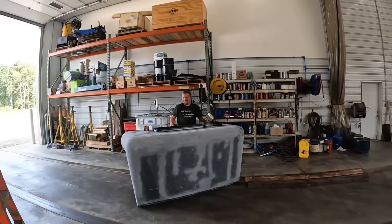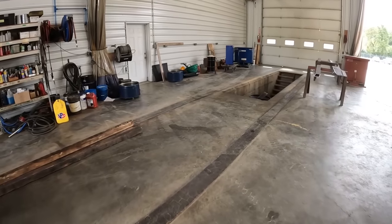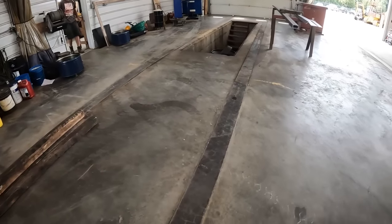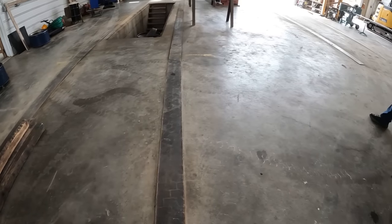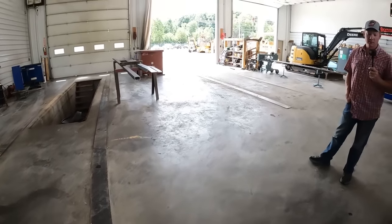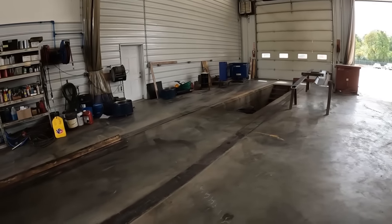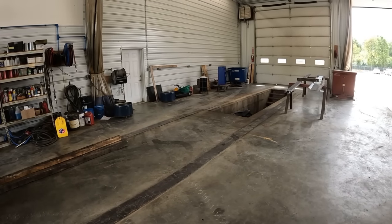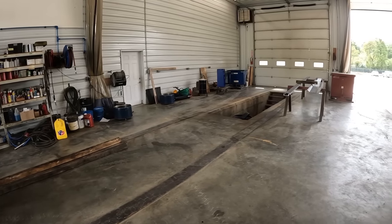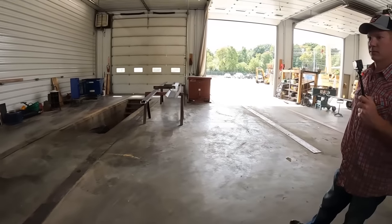Yeah, we're in the main shop. We've got steel I-beams, 8x8 I-beams. So is this sitting on a concrete footing in here? There is a concrete footing, yeah. I was about to say, because that would just push it through eventually. I've got a video on my channel doing the outside. There's actually three pads that they're welded to, and then kind of poured under, but there's floor heat in all the floor. Obviously, that's for the track equipment to save your concrete.